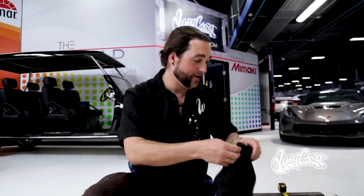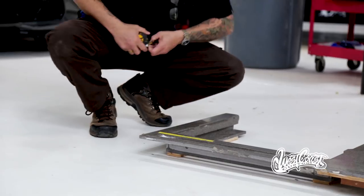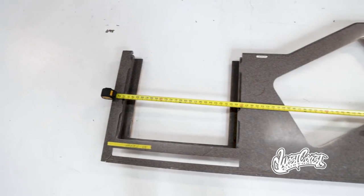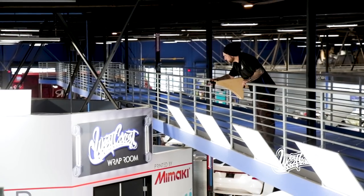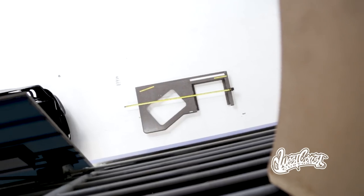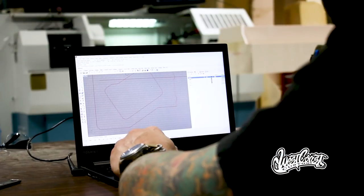What we're getting ready to do here is a little bit of photogrammetry using this custom rig that I built. Photogrammetry is the science of capturing accurate data through photography. I'm using this on the Marinella build to basically replicate the counters that were originally in the RV. This way I can take one or two measurements and draw the whole thing up based on that. After this, I'm going to take it onto the computer, correct for any lens distortions, throw it over onto the CNC router and cut it out.